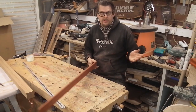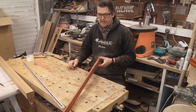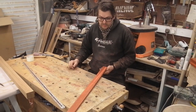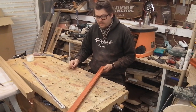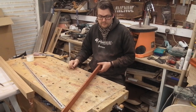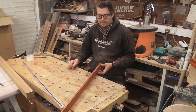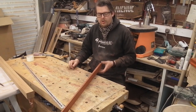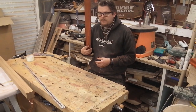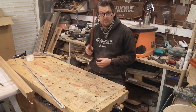Obviously the laminates between that — every glue joint and every different laminate will help spread the stresses and any desire that the wood might have to move. The glue joints themselves: it's kind of widely accepted that the glue is stronger than the wood itself. So a multi-laminate neck is expected to be more stable and stronger long term than a one piece neck. I also think they look really cool, so as long as it works I don't care whether it's more stable or not.